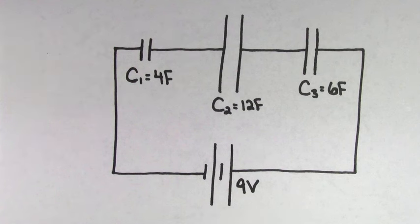To figure out why, and to figure out how to properly deal with this type of scenario, let's look at what's actually going on in this example. When the battery's hooked up, a negative charge will start to flow from the right side of capacitor 3, which makes a negative charge get deposited on the left side of capacitor 1. This makes a negative charge flow from the right side of capacitor 1 onto the left side of capacitor 2, and that makes a negative charge flow from the right side of capacitor 2 onto the left side of capacitor 3. Charges will continue doing this, and it's important to note something here. Because of the way the charging process works, there's just nowhere else for the charge to go but onto the next capacitor in the line.